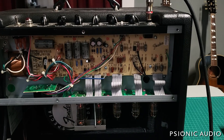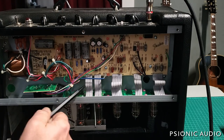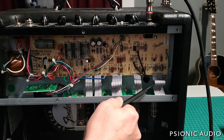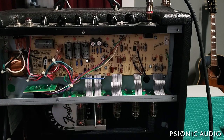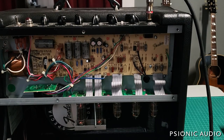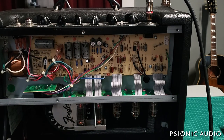So I'm going to give those pots a clean up — just a little squirt of DeOxit. But the other issue that these amps are very prone to is they eat EL84s alive. It's because Fender, when they designed this — and I use 'design' loosely — did not read the data sheet for EL84s. They pretty much bias this thing as if they were cathode bias as opposed to fixed bias, so that needs to be cooled off.